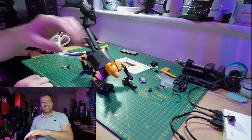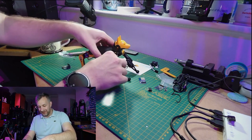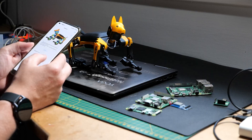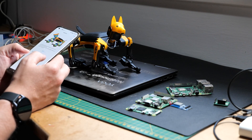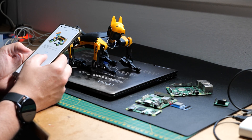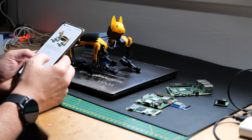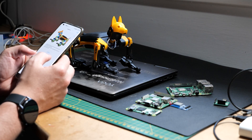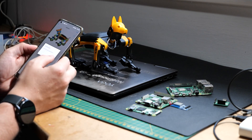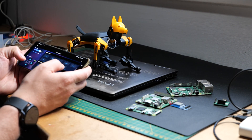If you just want to dive in, don't assemble the legs just yet — first go through calibration. Calibration is going to be super important if you want your robot to behave well. To complete calibration quickly, use the Bluetooth module provided, plug it into your robot and connect via the mobile app. That way you'll be able to set the dog to a calibration pose, lock the limbs in place, adjust them to the correct position, and voila — this was by far the quickest and easiest way to get everything working as it's supposed to.